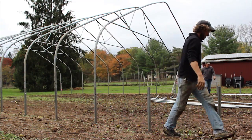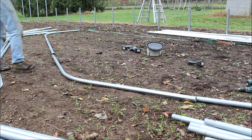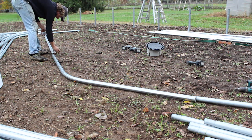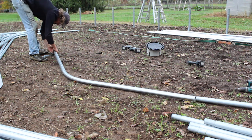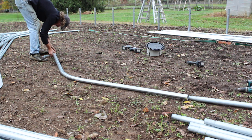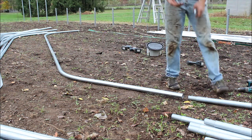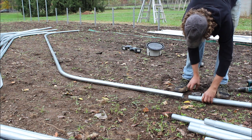a punched hole. For hoops that are going to have trusses and truss supports on them, it's easiest if you put the brace bands on the hoop before you assemble the hoop pieces. This way you can attach the truss and the truss supports at ground level and then put the hoop up with the trusses and truss supports already attached. You can see here that the brace bands are being slid on, and then the swage is being pushed into the center hoop piece. We'll do this on both sides of the tunnel because both sides will have connections for the trusses and truss support.